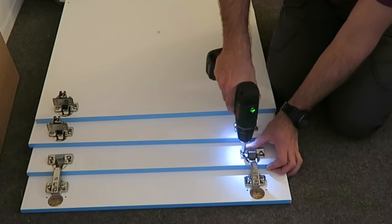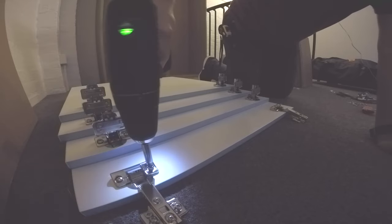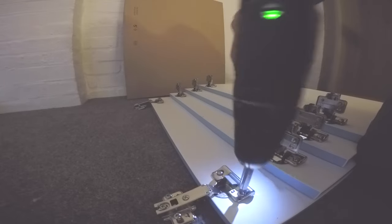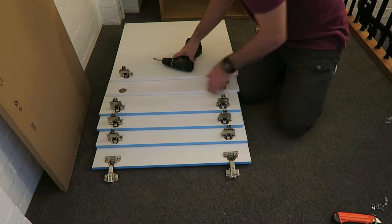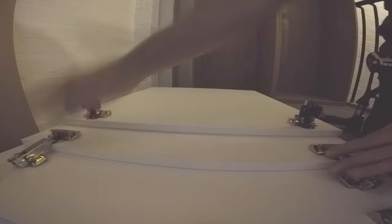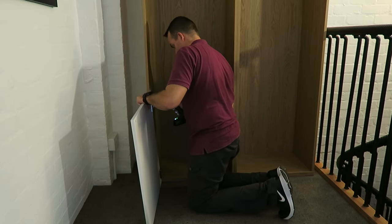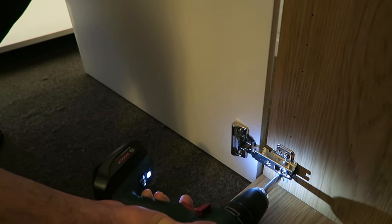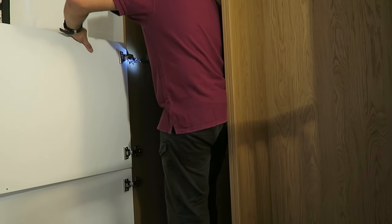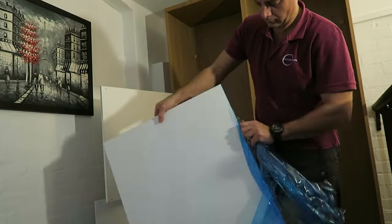For the hinges, we're going to have two hinges on each door. These are nice soft-closing hinges — two screws on each hinge, very strong. We're going to have six doors in total, so we have 12 hinges and two screws securing each hinge. At the end there's a small rubber piece — just place that in. It's to prevent the doors from slamming loudly.